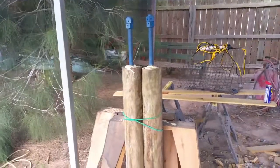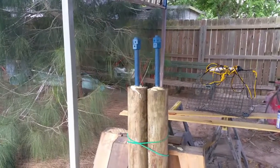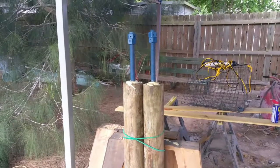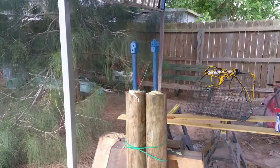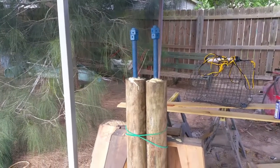There's a couple of pilings that I have ready to go. The bolts are in the piling 14 inches — it's a very tight fit. I had to screw the bolts into the piling and I coated the threads with Gorilla Glue so that would really seal it off. The nuts will come off; they're just used to screw the bolts into the piling.